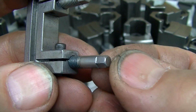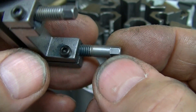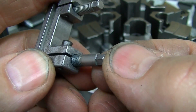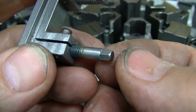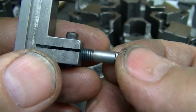Then I used a case hardening material. In this case, whatever it's called. Well, there's Caseonite and then there's Cherry Red or whatever. I used the Cherry Red stuff. Basically a powder that infuses carbon into the surface of the steel, increases the carbon content, such that when you quench it, you get a very mild case hardening.